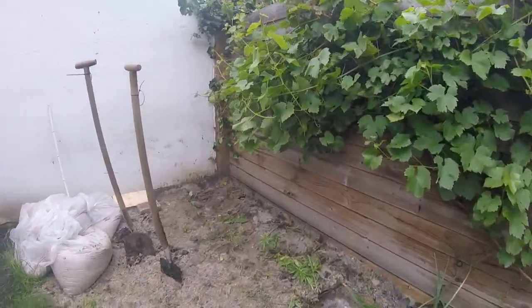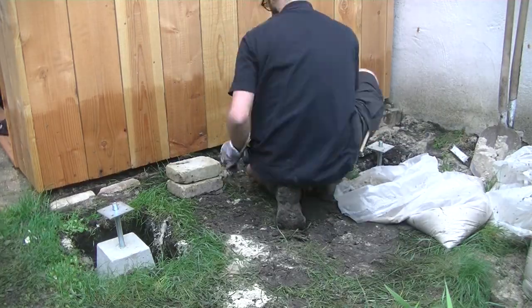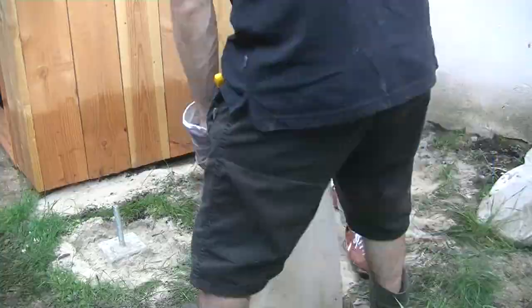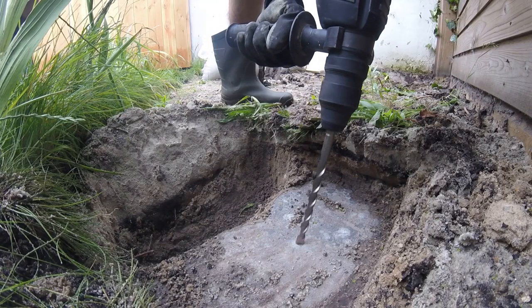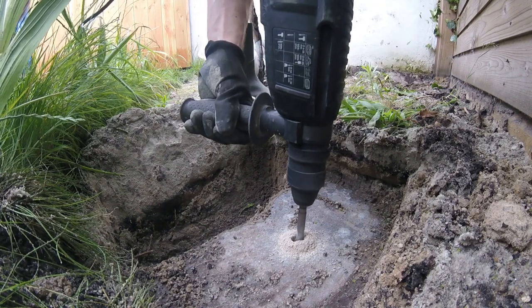Onto the foundations of the deck and pergola, I placed two concrete piers on one side. On the other side there was an old very large concrete beam underground — on that side I placed two completely steel anchors of half an inch or 12 millimeter, with nuts and washers and a quarter bracket for mounting.